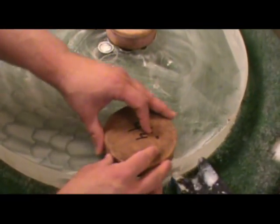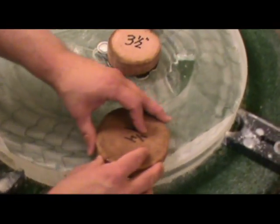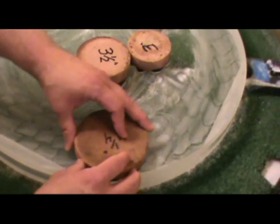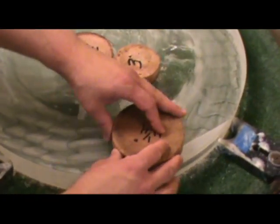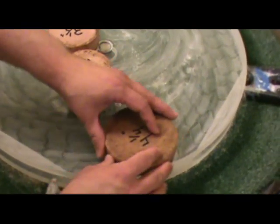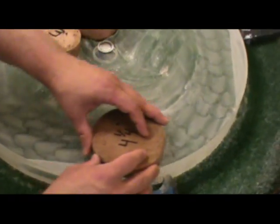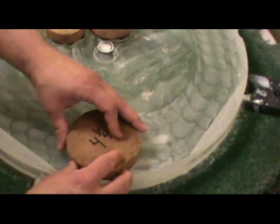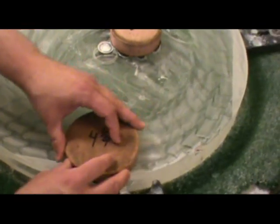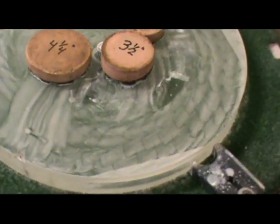This is a nice technique to use when a pitch lap isn't quite the right size for the zone. In this case the zone was really, really narrow — it's not practical to use a pitch lap small enough for such a narrow zone. So you rig it to fix the problem while spreading the incidental damage into different locations so it isn't as bad as it otherwise would be. That's the technique I use to fix a narrow high zone toward the outside of the mirror.